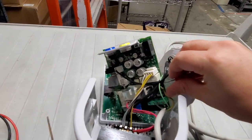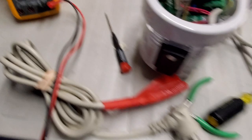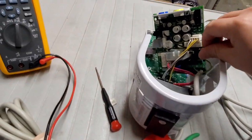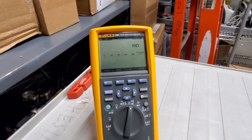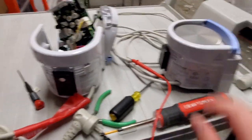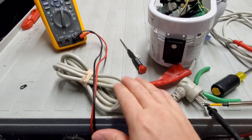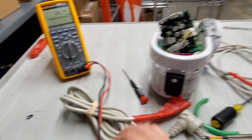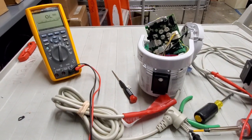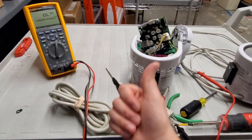Anyway, when I connect to the power cord itself, we are consistently getting over two ohms. So that will never pass electrical safety. And I've got so many of these that are like this. There's no physical damage, nothing wrong with it — it's just that for whatever reason, something's going on inside the power cord and the resistance is spiking. So these ones you have to completely ship back to Fisher & Paykel. That's all there is to it. If they don't pass electrical safety, you've got to ship them back.